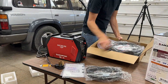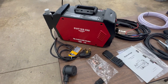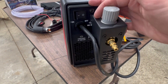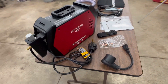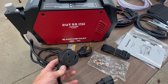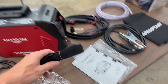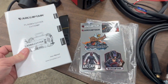First, let's take a closer look at this Cut 55 MP Plasma Cutter. Here's everything that comes in the box. The first thing that caught my eye is the design — how small and compact it is, and it looks great too. It includes a regulator so I can fine-tune the air pressure, and there's a built-in moisture trap as well. It's ready to go with a 220-volt plug, but if 220 isn't available there's an adapter to step it down to 110. We have a bag of extra consumables — tips, electrodes, and a couple of hose clamps. A shoulder carrying strap, instruction manual, and some cool stickers they always include.